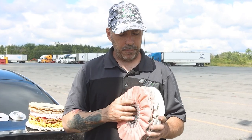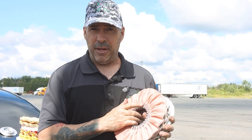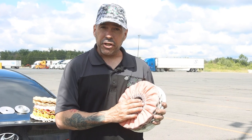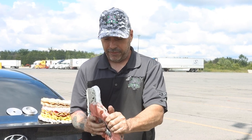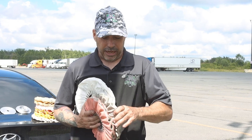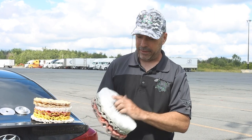My line of pads are going to be available extremely soon. What I like about my pads compared to other companies is, first of all, the manufacturer I'm dealing with is testing these at 6,000 RPM — that's going to be a bonus. There's not many companies out there testing their wheels or pads at 6,000 RPM, so we're going to be a little bit safer. The clinch ring is very, very strong. I like the fact that the clinch ring is the same size as my flanges. The material is really good. My heavy cut is stiff — great to work with, zero vibration in all the ones I've tested so far. Same thing with my medium cut. I like the stiffness of it, and I think I'm going to be able to do some finishing with this as well on stainless. And my flannel is just the normal flannel pad that most other companies have.